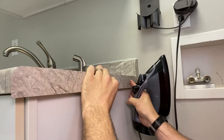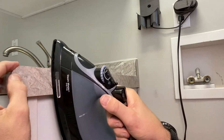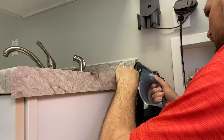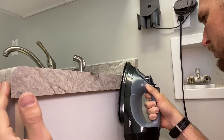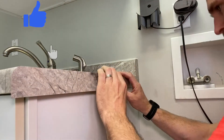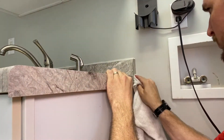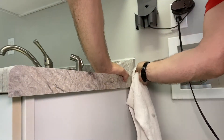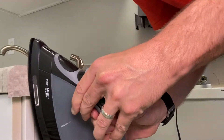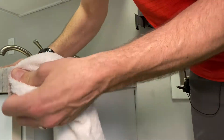With the end cap properly sized, now it's time to get it adhered in place. Using the iron, I'll start in the center section. It's a little hard to see because everything's sped up, but I'm spending about 10 seconds in each area to properly heat the glue — and for reference, the iron is set on cotton. You'll also want a damp rag to cool down the glue and to apply pressure along the entire end cap. Then check to make sure everything is adhered properly. If there are any loose parts, just get the iron back out, heat those up, cool them down with pressure, and you should be good to go.